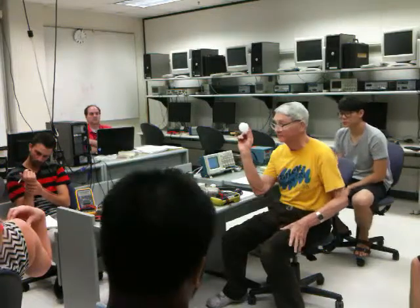I'm inserting one more thing that's not in the instructions, but it's kind of fun to do. What is the resistance of this bulb, which is pure resistance, when it's running under normal conditions? Let's see, power is volts times amps. Forget cosine because it's a hot wire, there's no reactive component. So power is volts times amps, also V squared divided by R, so R equals V squared divided by power. 144 ohms, I believe you.